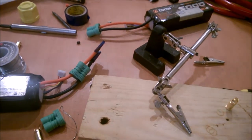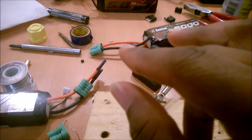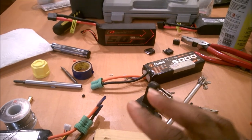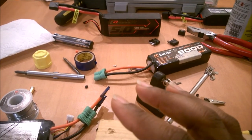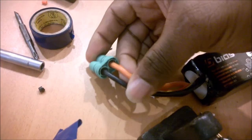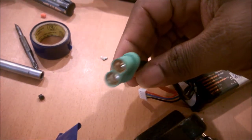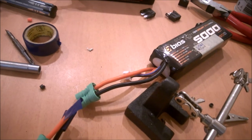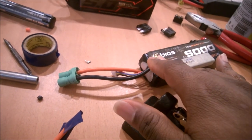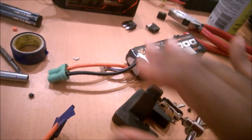Remember to like, comment, and subscribe, and remember the mantra: fly, fix, fly — break it, fix it, do it all over again. Take good care of your batteries because the last thing you want is to cause a fire and burn up your vehicle over a silly soldering mistake. You only need a little bit of insulation stripped off. One of the nice things about these connectors is you don't need heat shrink — everything's secure and it's a really nice semi-foolproof connection. Because it's polarized you can't plug it in backwards. They're a little more expensive than some other connectors but the features are worth it.